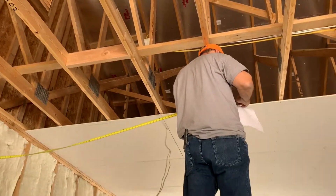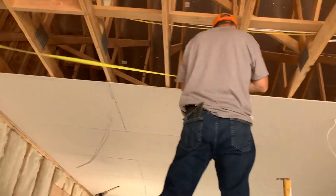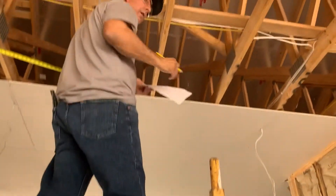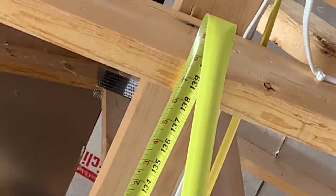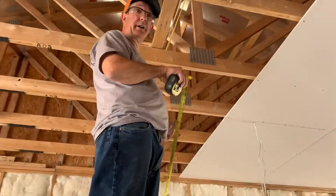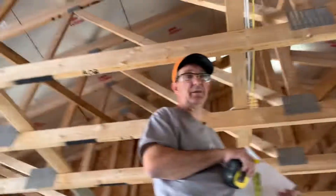144 and four. 114 and four. I got 138 and six — that's my overall cut, 138 and six. The number six equals three quarters of an inch. The reason why sheetrockers talk that way is to conserve energy — it's a lot better to say 138 and six than 138 and three quarters.